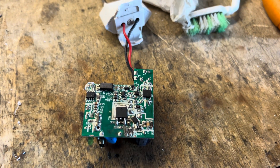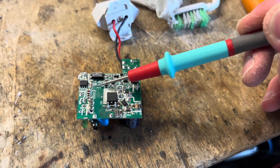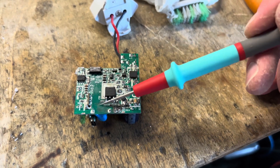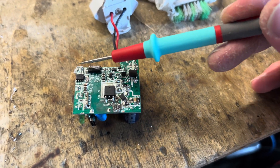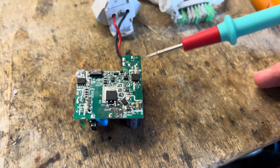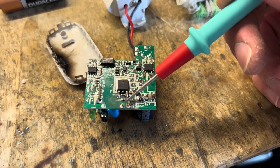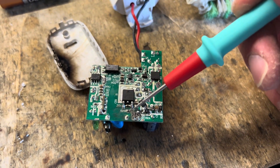It actually took me a little bit to understand the circuit, but this is actually the separation between the primary and the secondary. I thought it was this line here for whatever reason, but it's actually this one and it's much larger and probably far more acceptable. I actually didn't notice that here there was an optocoupler. So this is basically the secondary and this is the main switching transformer. All the soot, blackness, explosion and everything happened because this part of the PCB just turned into vapor.